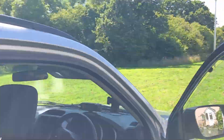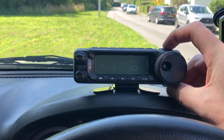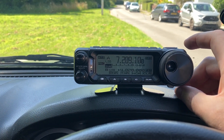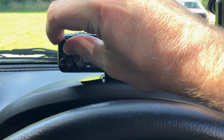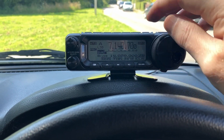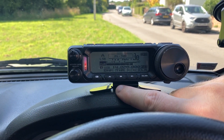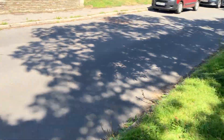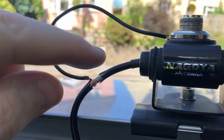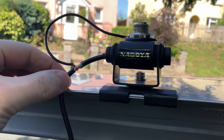Right, let's give it a go. We've scraped off the paint on the boot - not done any proper earthing yet. We've also shorted across here to the coax to bypass the dodgy joint. See if the tune button works now - is it moving? Turns out it wasn't even that.